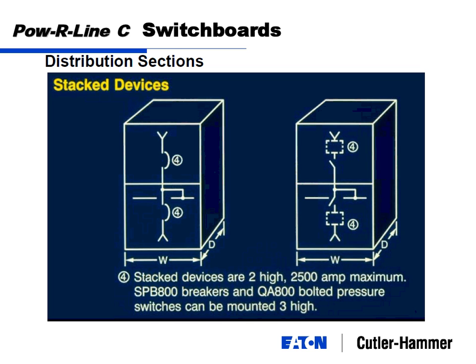if you've got, if this is your A, B, and C bus, you can stack breakers one on top of the other. These things here, boom, boom, boom, boom, boom, all the way top to bottom, as many as you can fit in. When we talk individually mounted breakers, we don't have this chassis for stacking.